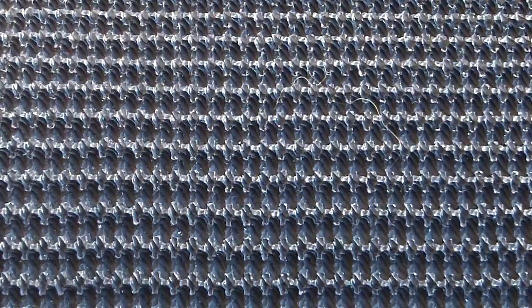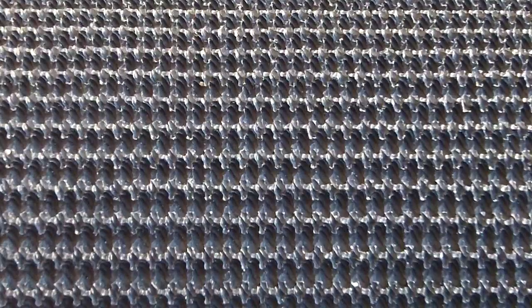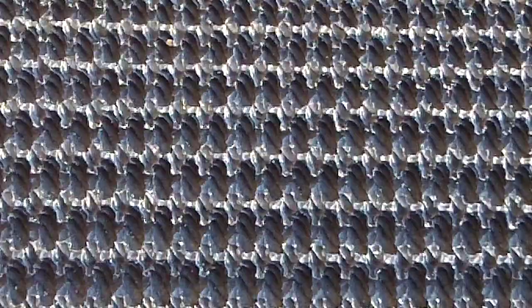The key to the whole success is in the mat. There are two different types of mats that are very similar — they're called rough top conveyor belt mat. One is called the vortex mat, which is used on the gold cube. The other one is the Martin Gold Stop mat. This one I'm using is the Martin Gold Stop mat, available from the Martin Prospecting Company online or on eBay. As you can see, they are composed of thousands of very tiny little pockets. The gold drops down into those pockets and is trapped there by the black sand that covers them over.